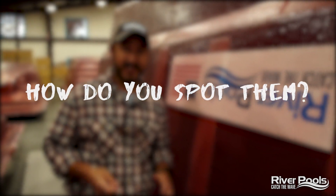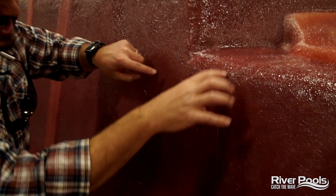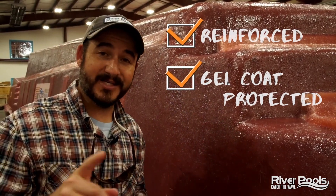When you're shopping for a big purchase like an in-ground pool, it's really nice to know what you're looking at and being able to spot all the things that you need to have in place. When you go shopping for a pool and you're considering a manufacturer or a pool model, look for elements like honeycomb structural support on the ribs or gussets over here on the safety ledges or down here on the coping. As for the woven fiberglass roving, this one might be a little tough to spot, but what you want to look for are distinct lines running in and around transitions. If you see a line like this, that is the edge of the woven fiberglass material, which now has a nice layer of chopped fiberglass over top — meaning that the transition from the wall to the surface is very well reinforced, the gel coat is very well protected and is not going to crack as this pool is moved, handled, and installed in your backyard.